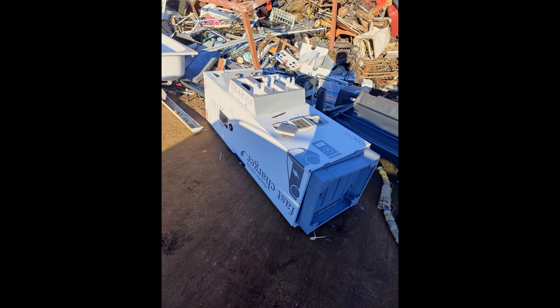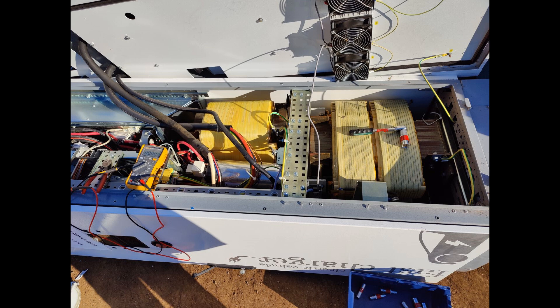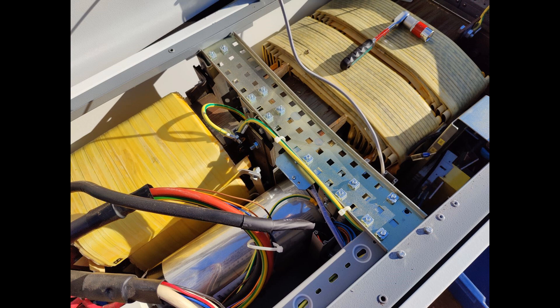When we have opened it up, you can see the inside of it. At the bottom we have a pretty large transformer. You can see the wrench on top there, and the primary and secondary windings that are separated from each other. On the left side of the transformer you can see a choke and some capacitors, which are those silvery cylinders. Just for safety, I have checked the capacitors and confirmed that they are discharged — that's why there is a multimeter. Here's a closer look: you can see the wrench on the transformer, the choke, and the capacitor.